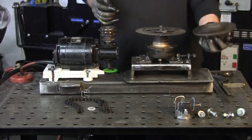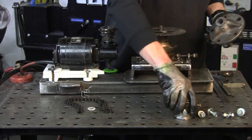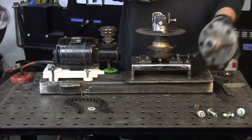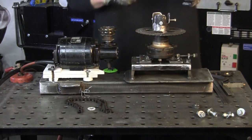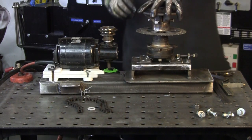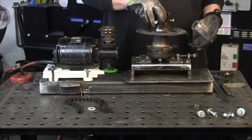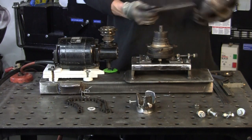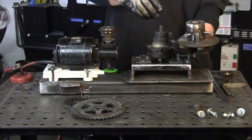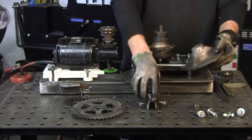Now what are we going to do about the main hub for the turntable? This is cast, so I can't really weld on that. What I did is I made a little holder that will slip in over it — the nut will tighten first, then I put divots and set screws so it'll fit right in and you can dial it in to keep it nice and flat. I could tack it onto the sprocket, but what's the point? If I want it to go slower, I can change out the sprocket. This keeps it nice and tight, and the main thing is you want it centered — you don't want it rocking.